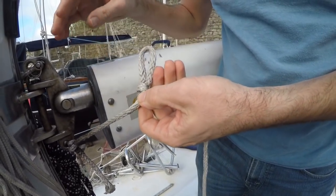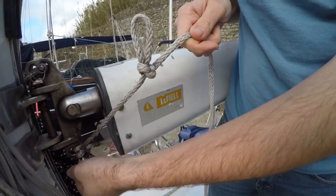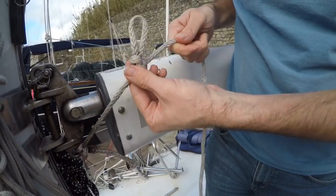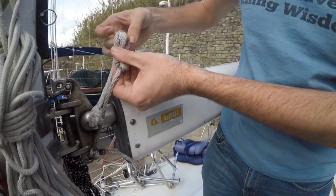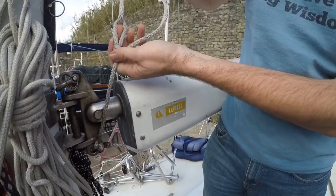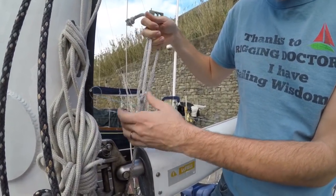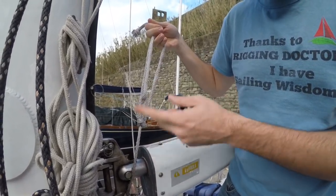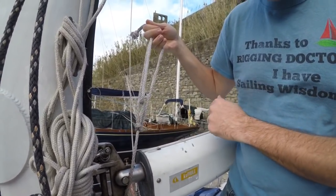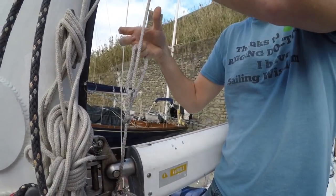The purpose of this one, for example, is it is actually our tack line when we reef. It's tied off at the gooseneck with a bowline and then we have the alpine butterfly hitch. When we run the tack pennant through the sail we can create a purchase system — great for making a trucker's hitch. If you ever need to make a trucker's hitch or cascade system, having the alpine butterfly hitch will let you have that mechanical purchase right there.